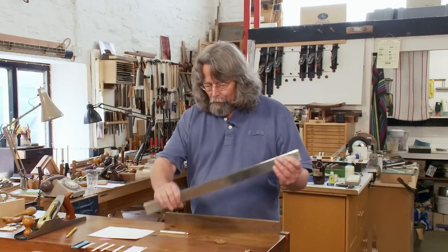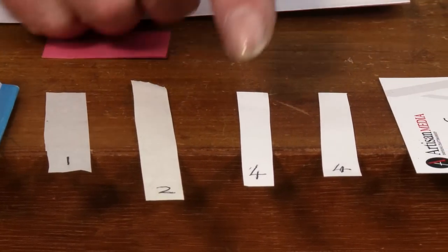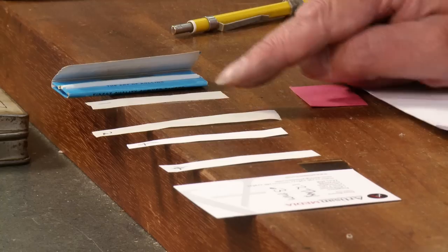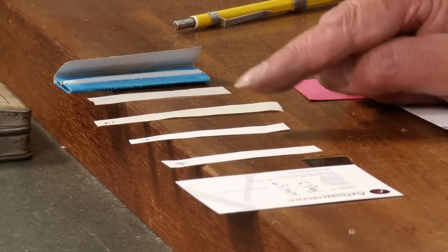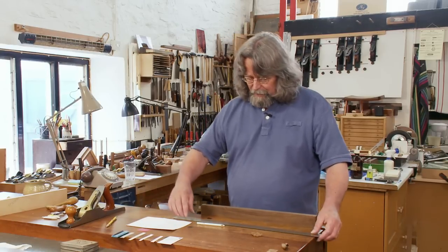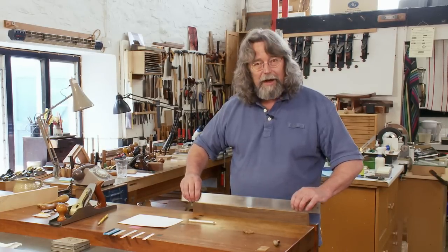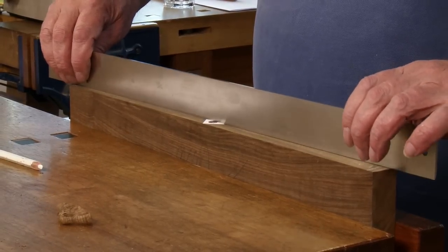We can assume that this is hollow, and it might be fun to try and measure it. I decided to start measuring with readily available cheap things like thin cigarette papers, newspaper, and writing paper. Thin cigarette papers are 1 thou, newspaper about 2 thou of an inch, good writing paper about 4 thou, and a business card is about 0.3 millimeters which is 12 thou. To find out what's going on, I'll put the business card in — and the straight edge is pivoting and rocking up and down.